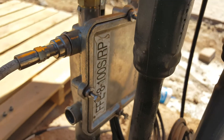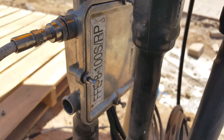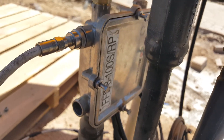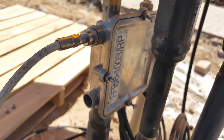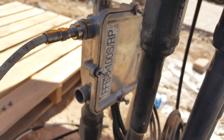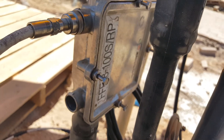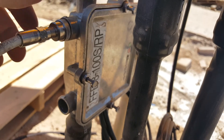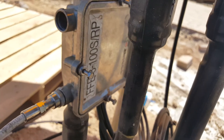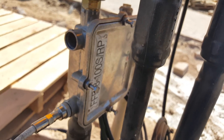So I noticed we have an equalizer here. This gives me an opportunity to knock down the lower frequencies because they tend to get a little too strong as you get further from amplifiers, since low frequencies don't attenuate as fast as higher frequencies. This also gives me a chance to raise the transmit because this has a diplex filter in it and I can separate forward and return and put in a pad to raise the transmits.